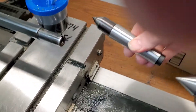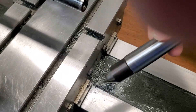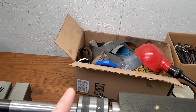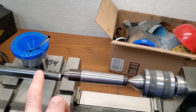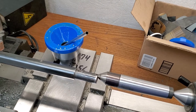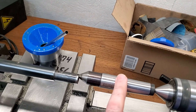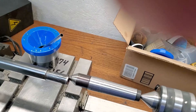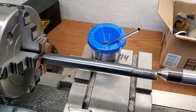Here's a little trick — I'll be honest, I don't remember where I learned it from. If you take a dead center, the point of the dead center falls perfectly into your center-punched hole. Before I drilled the hole, I scribed where I needed it and used a center punch, so the dead center located it exactly. But to be able to indicate the barrel in, it's kind of tedious.